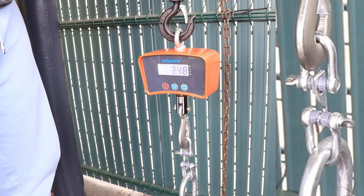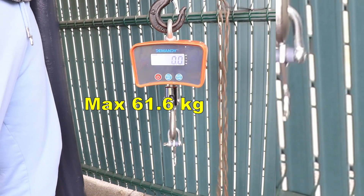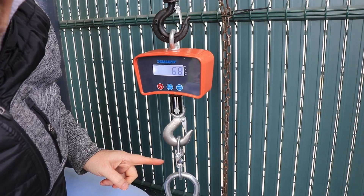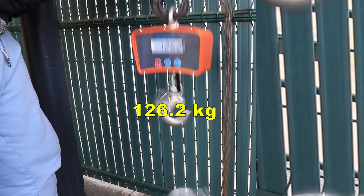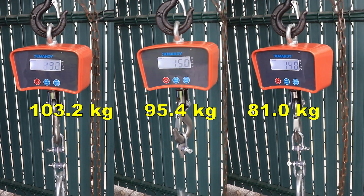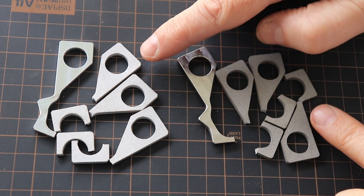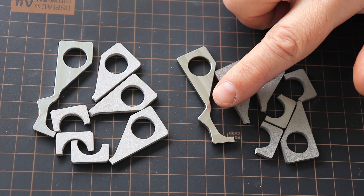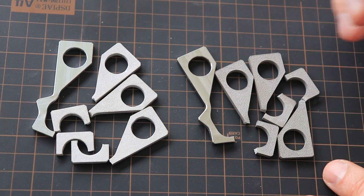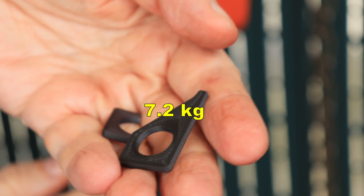Starting with CNC machined aluminum, then 3D printed aluminum, then CNC machined steel, and 3D printed steel. This is aluminum and this is stainless steel. One thing is very obvious: 3D printed parts are more brittle. The CNC machined parts just started bending around this point, but I noticed that 3D printed parts start bending a little bit and then at some point they just snap into two pieces. And just for fun, let's see how FDM 3D printed plastic performs in this test — hardly measurable.